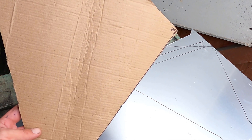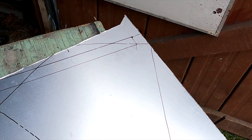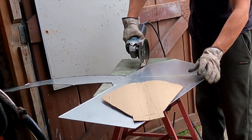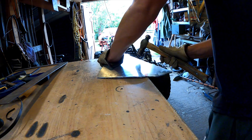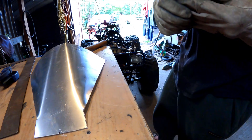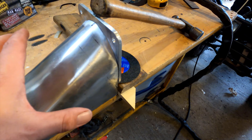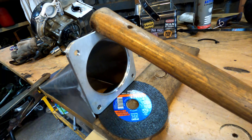I've cut a cardboard template out for my intake now. It's just time to cut it out of aluminium. I've beaten this all around with a hammer — it's kind of the shape I want, it's pretty close actually. I'm going to start tacking this together. I'm going to have to pull it in a little bit further so that it's the same diameter as that.